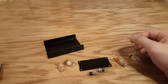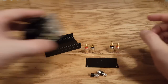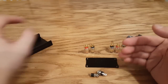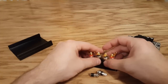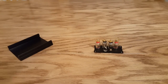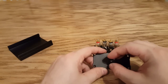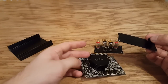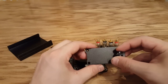After you've figured out which way you want to orient the board, we're going to decide how to fit everything on the back panel. You need to pay attention to where this board will be once it's in the box — mine was just under a half inch — so that means I cannot have anything underneath a half inch, because if it touches it'll hit the board. I decided to orient the binding posts up above that. The front plate is going to be simpler — just need to be a half inch up, and left/right doesn't necessarily matter, though I'm going to offset it to make it neater.